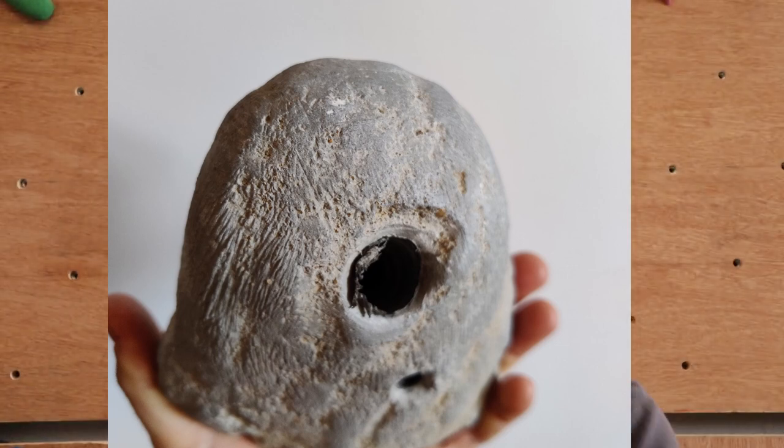Working with green concrete is really horrible on your hands — wear gloves because it will dry your hands out badly. You can start by brushing and scraping off the sand with trowels and either a soft or wire brush. That also helps start to round the shape over, and you can get some refinement on it. There will always be fine curves you haven't quite nailed from the sand casting, but you have the opportunity to really smooth out the hold and make the shape quite aesthetic. The first level of finishing leaves a grippy but uneven texture; the next level uses more aggressive brushing to get a lovely brushed texture that's much nicer on your skin.